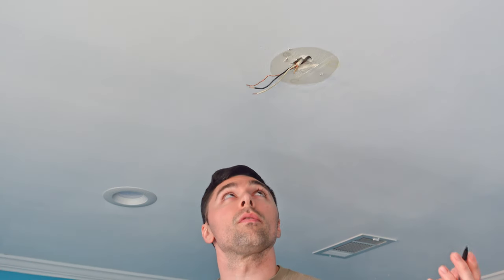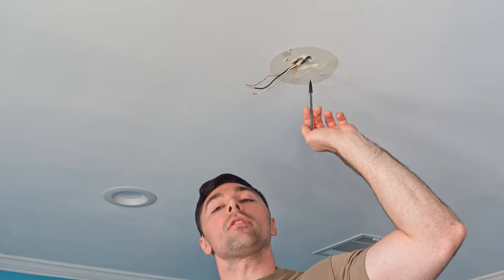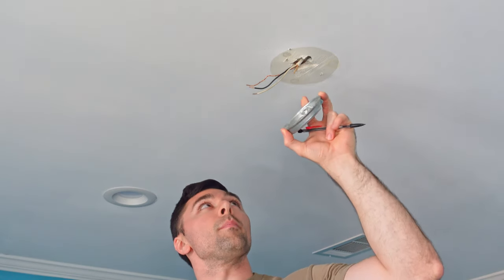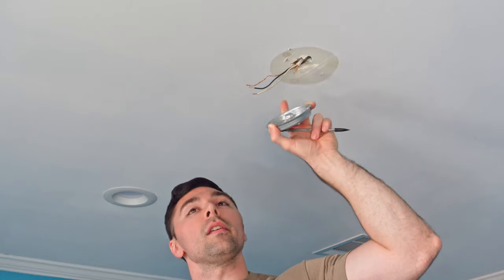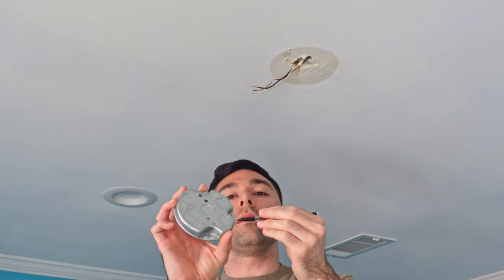My next step is I need to install an electrical box. If you already have an electrical box in the ceiling, you won't have to do this step. But whether it was because the house is older, it was okay by code back in the day, or the electrician was cutting corners and went against code — to bring it up to code at minimum, I need an electrical box here. So I'm going to have to cut the drywall out and put in an electrical box. I bought a pancake style box, which is going to mount to the surface of a 2x4. I just need to cut the drywall away big enough to put this 4-inch box in, then bring my wires in, secure them, and mount my new fan.